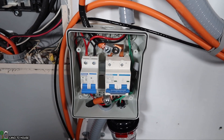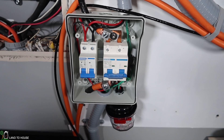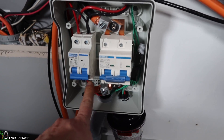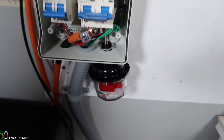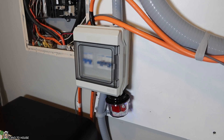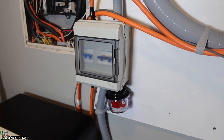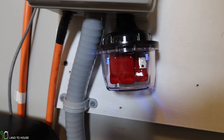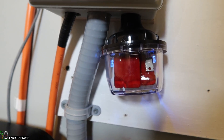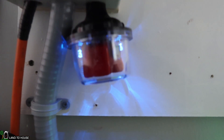And that's the basics of wiring in the midnight solar surge protection device. Let me go ahead and get my solar wire into the bottom of this breaker and we will test the unit's LEDs to make sure that they turn on. I now have three kilowatts of solar connected to this SPD with 400 volts, so it is more than enough to get this to turn on. You can see the two little LED lights showing that this is working properly — I'll show you what that looks like here in the dark.